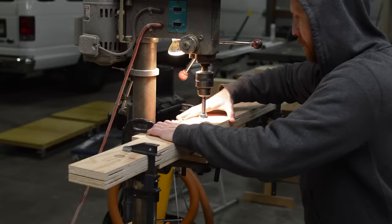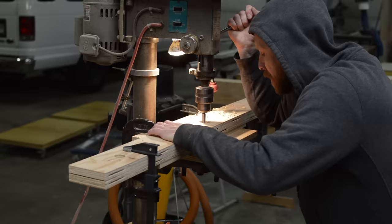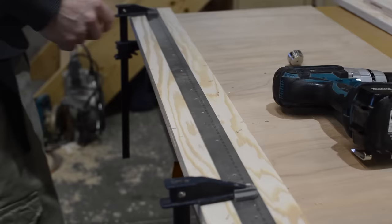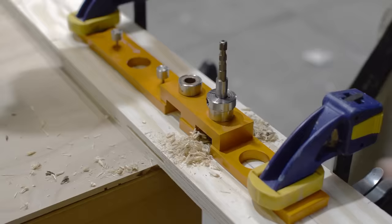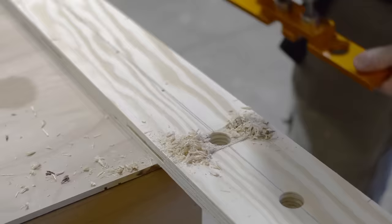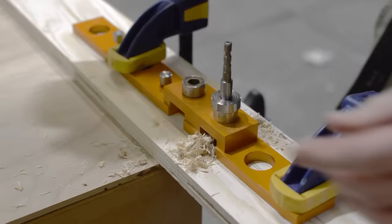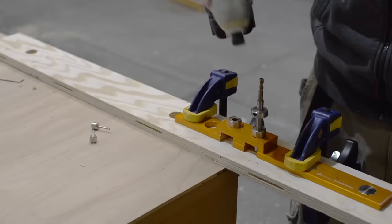Once I'm happy with all the joinery holding the boxes together, I mark and drill two one and one sixteenth inch holes for the pipe clamp vise. Next I break out the PARF Guide system that I spoke of earlier and I drill a row of 20 millimeter dog holes. If you'd like more information about this jig, you can search online and get hundreds of videos. Better yet, visit my channel — I have a video called 'A Modern Cabinet Maker's Workbench' where I use this very same guide to drill a bunch of holes and talk more about how it works.